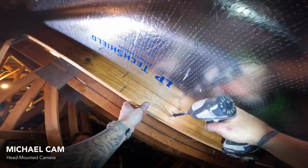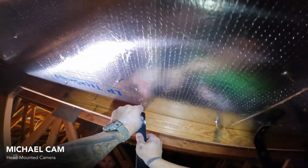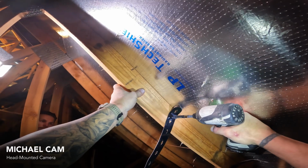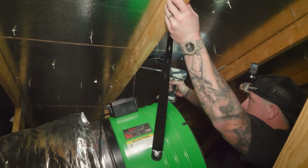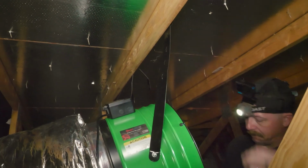Now it looks like these are very malleable and you can twist and turn these to whatever you need to do. Pretty much anywhere you need to make this bend, it will work in your favor. Now that we have the fan supported, we can finish these screws up. And then just add another one right on top of it. Finish it up. What are you thinking? Plenty of slack in this thing to be able to support it with the duct strap, it looks like, and you have great distance, it looks, between the motor head and the damper box.